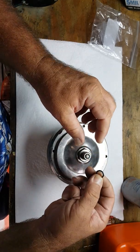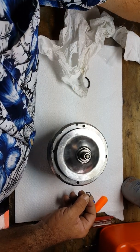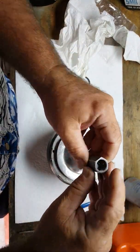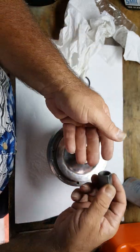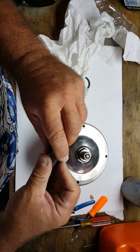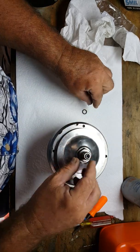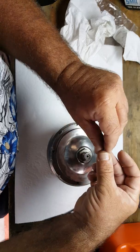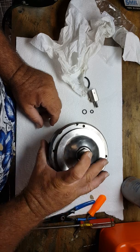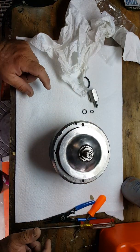Here, I'll show you so we have it. Here we go. This is the cap. This fits down in there like that. And then we go ahead and screw. Once you screw this down, it's going to smash that nylon ball down in there. So it's actually a secondary seal from the inside that we just put in there with the spring and the C-clip or the True Arc. And then this would be on the outside. So it'll seal that gas in there forever. So there it is right there. We're going to tighten this down and fill it with gas.